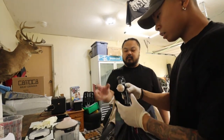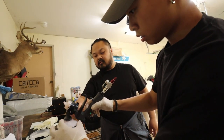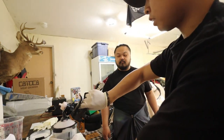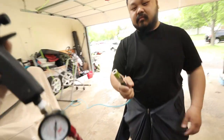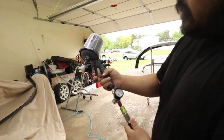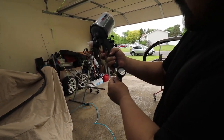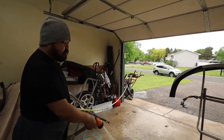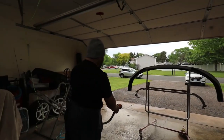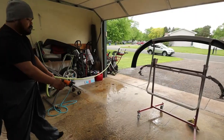Just turn it upside down — it snaps in there, and once you turn it upside down it won't leak. There you go — gravity fed. Now we hook it up to the air compressor. When we spray we're going to go to 25 PSI. We're also spraying down the ground so that dirt doesn't come up — if dirt comes up then we've got a messed up project. It also makes it easier for cleaning up after you're done painting.